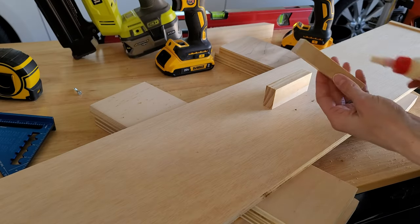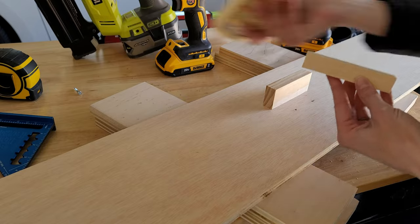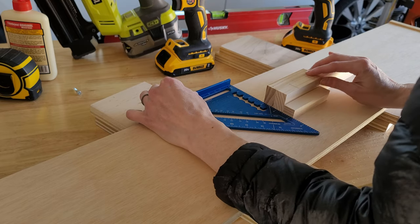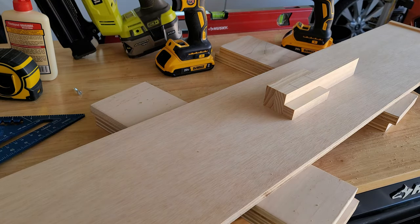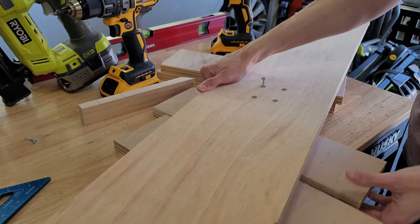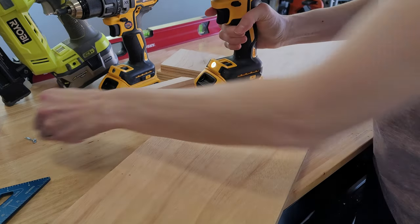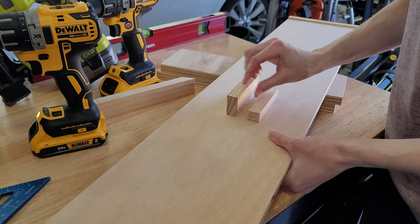It's really the same step for the front of the stand — add your screw with a little bit of pop-out so you can see where it's going to land. Take a moment to find the best side of the dowel to show, making sure you're not showing a roughed-up edge. I used that spacer board again to make sure it was perfectly spaced and not crooked. Then I had to readjust my boards to make sure there was support underneath that shorter stand — scrap wood really helps here. I'm using about one-and-a-quarter-inch Kreg screws, just the right length for this project.